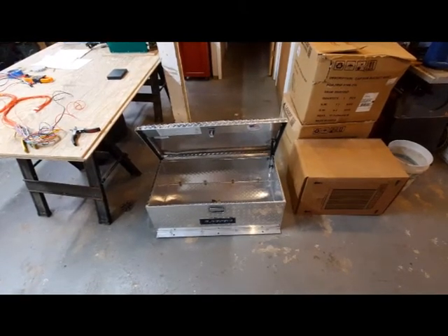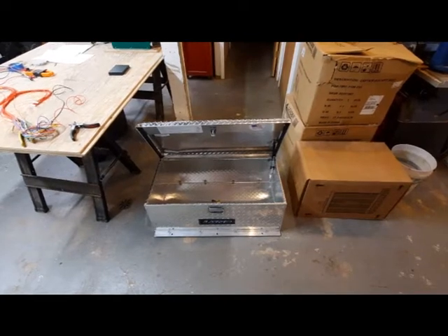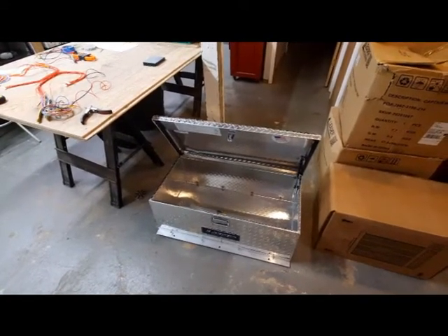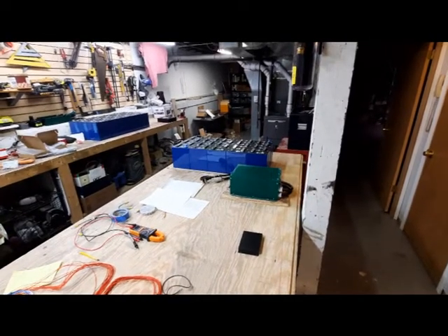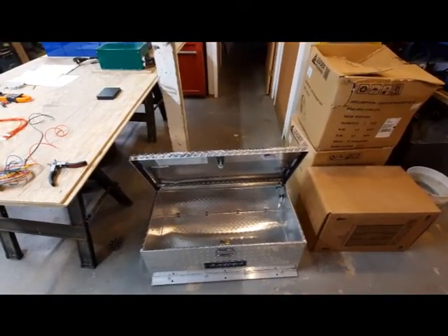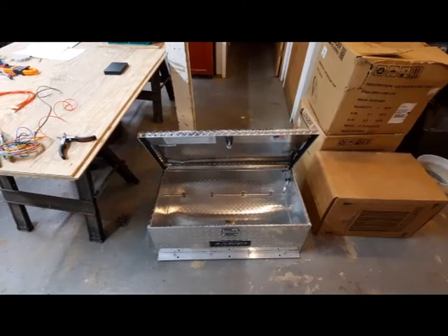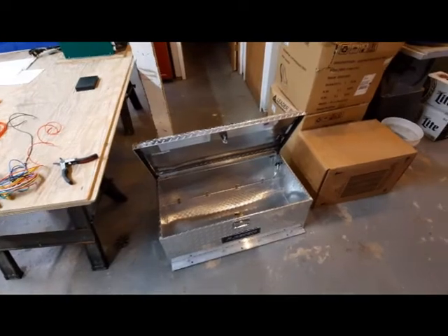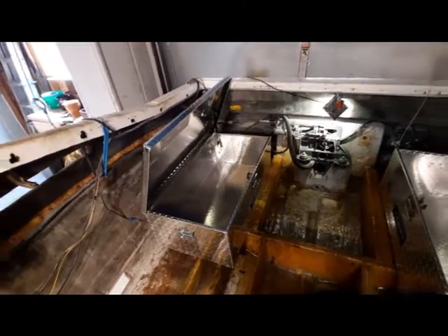I spent a lot of time on battery enclosures. I was going to make one out of PVC, possibly with a fiberglass layer on it, but I ultimately decided to get these aluminum truck boxes for storage. The inside measures 18 by 36 inches, and each battery bank measures 17 by 35, so I'm going to have a half inch all the way around. That'll be shimmed with a half-inch PVC board, with threaded rods going through and steel bars on the outside. I've decided not to compress them, but to fix them in their current state to minimize expansion — that's debated, but that's my choice. Here are the new battery boxes, just temporarily sitting where they're going to be.